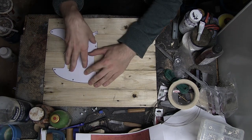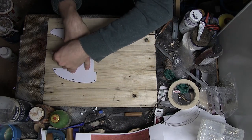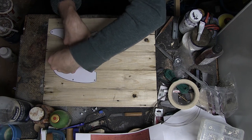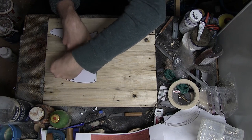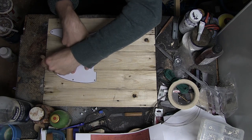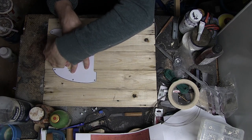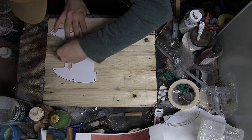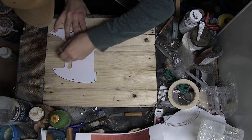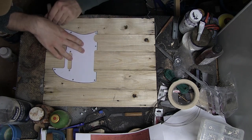And I'm going to hold it in place, and I'm going to take the knife that I need to trace, and I'm just going to cut into the wood. And by cutting with a knife that has only a bevel on one side, I will get a close connection that is perfect, a mirror. I don't have to think about things like the thickness of the pen I'm using and what that does to the transfer. I just have to think about the actual shape.